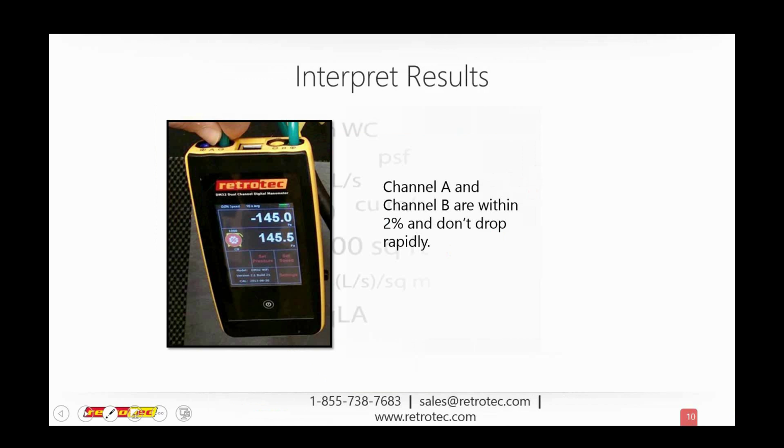Then you take that tube, which will normally be a red tube if you're inside the building, and that red tube is common to each channel of your gauge. So we're commoning the reds, or commoning the outdoor, but we're running separate tubes to different places indoors because we want to see how the indoor pressure is different. We need to measure those pressures to a common base, and we establish that common base by manifolding, or teeing, all of the red tubes together. Inside the building, we'll be running blue tubes at different parts of the building.